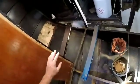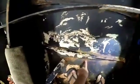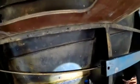So just so I could demonstrate some of the stages that are going on here, we've got chipped and swept through this station, if you like. This one here's just swept, so it hasn't been chipped. Got bubbles of rust like that. They don't take long to chip away. Into these corners here are a little challenge, but it really doesn't take that long. The needle scaler probably can't get into that sort of stuff anyway, so the chip hammer doesn't actually take that much time to do this open stuff. It's this stuff that takes time. So I'm really not sure if the needle scaler's got economy to it, but I haven't used one, so I don't know.